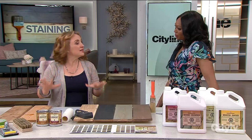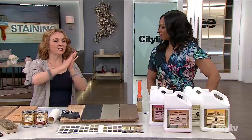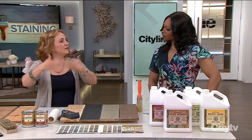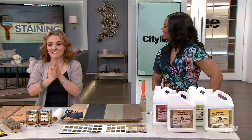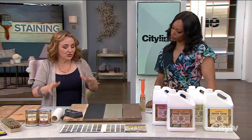Now you're ready to stain, but before step two — checking the weather — you need the wood to be dry. It needs to be totally dry and porous enough to accept the stain. You want it to take your stain, not the rain. You want a good couple of days of dry weather before you start staining, and ideally a couple of dry days ahead as well. Two days dry before, two days dry coming up — that's the ideal situation.